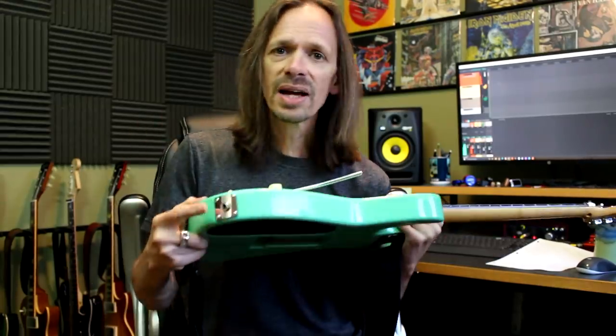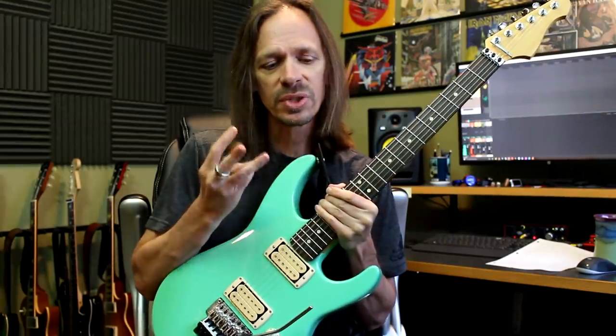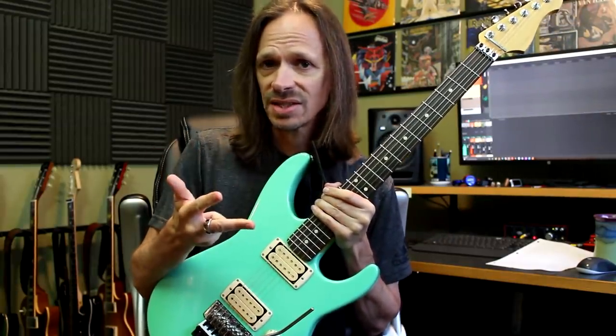So the tolerances and changing specs from hardware manufacturers are why we don't drill pilot holes for tuners, input or output jacks, or pickup rings — you really just need to use the exact one you're going to install. Moving on: talking about the side jack hole itself, Warmoth offers three sizes: half inch, three-quarter, and seven-eighths inch.